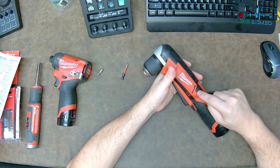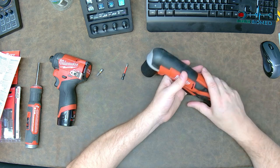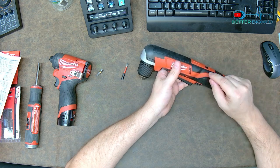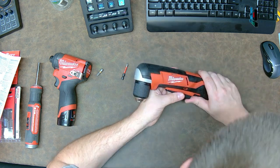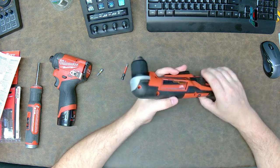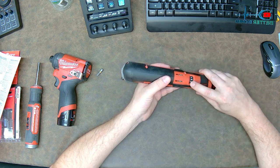I might keep it regardless of that other LED being boogered up. I'd love to tear it apart and see the planetary reduction because this guy is really spinning in there. You can get it really slinging, but at the same time look how slow the slow RPM feature is. Now with a brushed motor it's actually a little bit difficult to get that kind of range, and I can hear the SCRs doing the pulse width modulation for the motor. That's why it's got such good range - the digital circuitry, which is also backed up by the digital torque limiter.